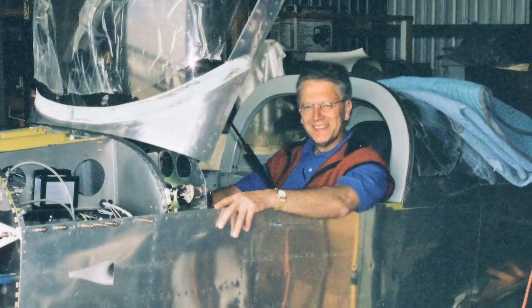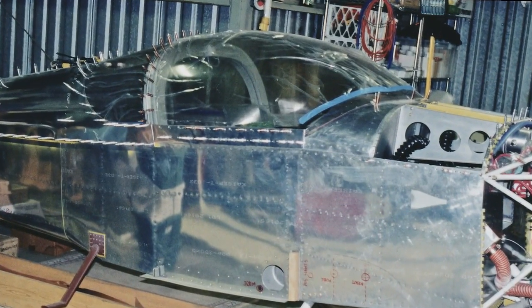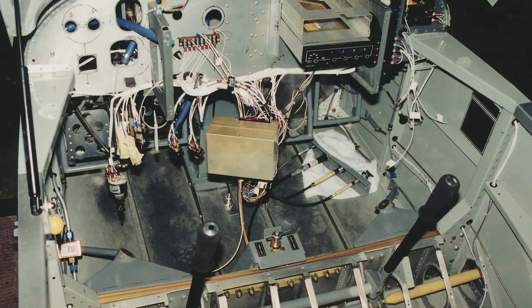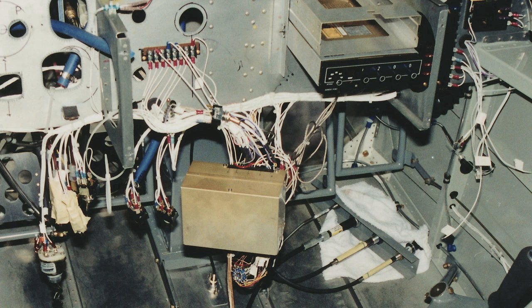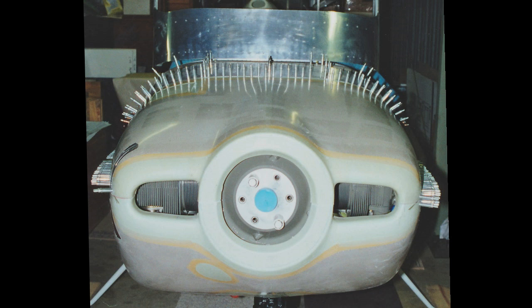In January 2001, I could sit in what appeared to be a nearly-finished airplane. The finishing kit was a beetle-sized box containing one of the biggest challenges for a builder: fitting the plexiglass canopy. One slip of the die grinder and it was a $1,000 start-over, with no guarantees it wouldn't happen again. Using one steel pull-rivet instead of the required aluminum pop rivets would shatter the canopy — I checked every rivet with a magnet. The wiring, which never gave me concern, soon grew to a tangle of wires I put happily in place with no wiring diagram. Hey, I'm an electrical engineer — that's what I do. The engine cowl was another area of laborious fitting and refitting; the appearance and safety of the airplane would be determined by how well these parts fit. They did.